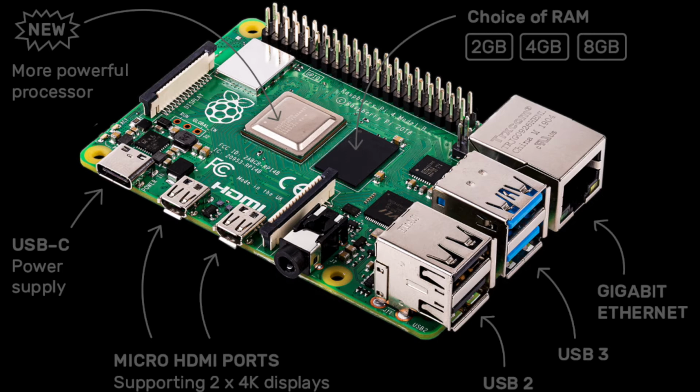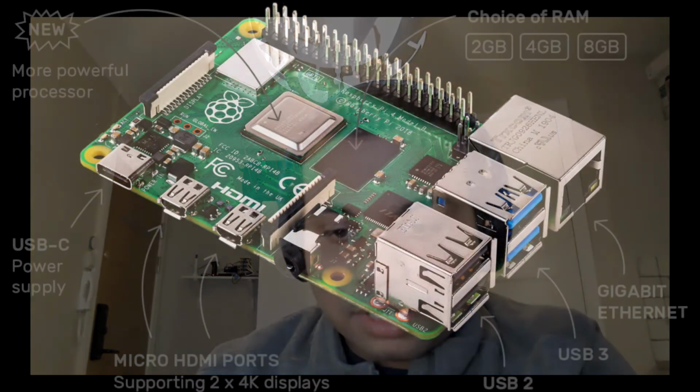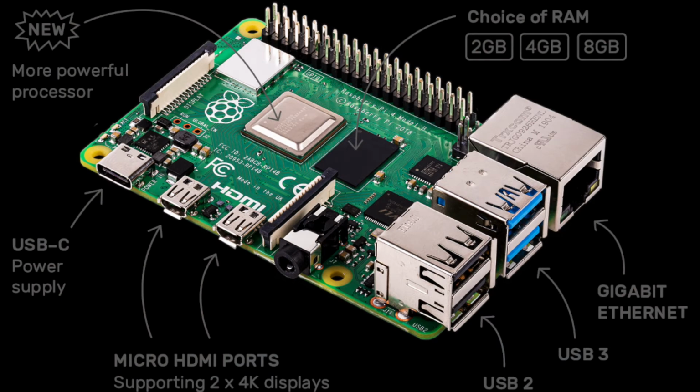Using these ports, you can connect an external display or monitor if you want. But in this particular procedure, we will not connect any monitor. We will use this Raspberry Pi as a headless unit, so there will be no display or graphics. Next to those micro HDMI inlets, we have this 3.5 mm audio jack. Of course, the Raspberry Pi is not only built for computation; it's also built for personal computers, so you might be interested in playing movies or doing things where you need a microphone inlet.